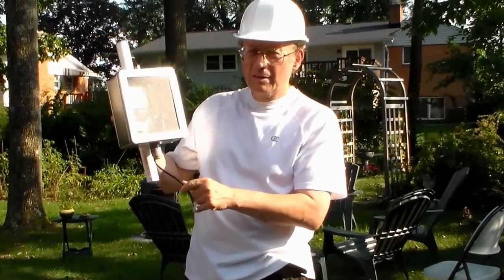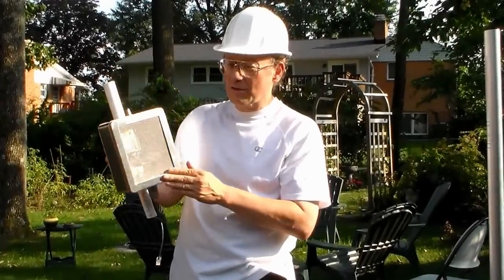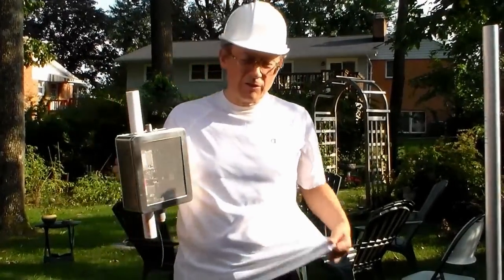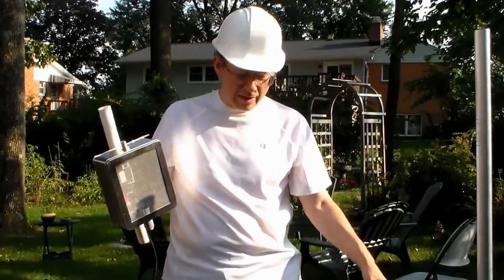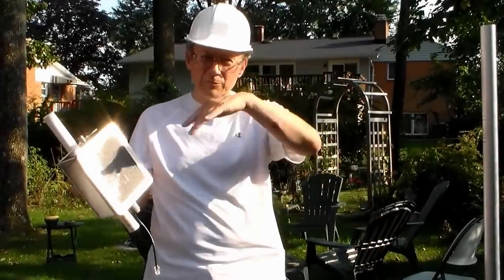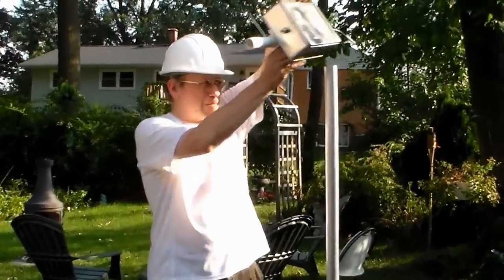Even with such a low power, you're going to be able to transmit 57 miles — that's the test. We've succeeded with 13 miles across Shenandoah Valley. At 13 miles we only ran one antenna; here we're going to use two antennas. It gives us another 3 dB, but two antennas times both ends is 6 dB. Anyway, this slides right over it — it's a friction fit.